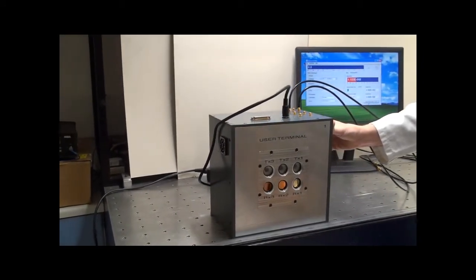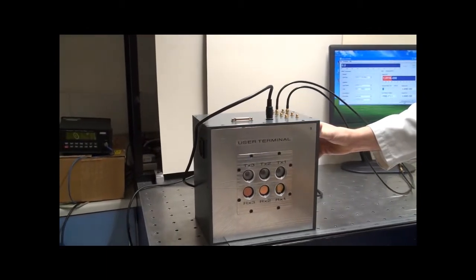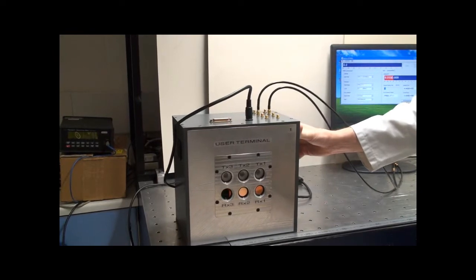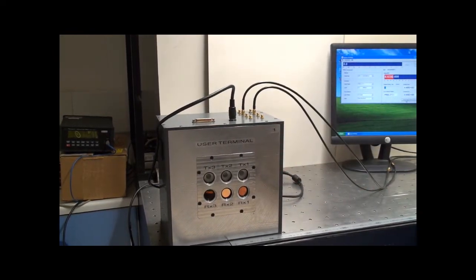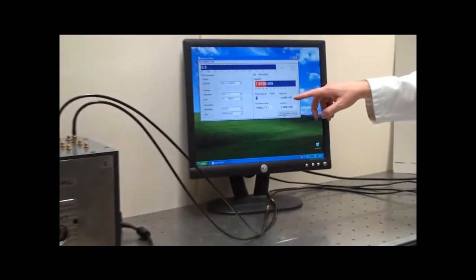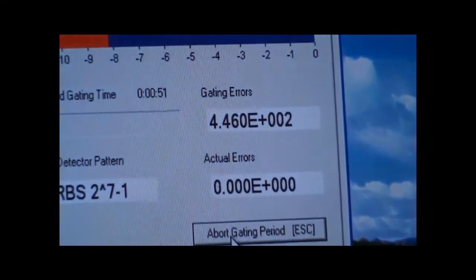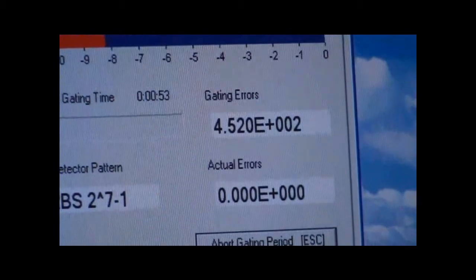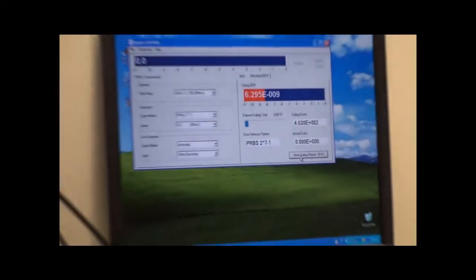We continue to move across. I'm going to stop there because you can see that we switch between the 3 channels, and you can see that there's only been a few errors. If I continue, obviously we'll go out of the last channel and there'll be a lot more errors. Our coverage is around 1.3 meters at a distance of 3 meters away.